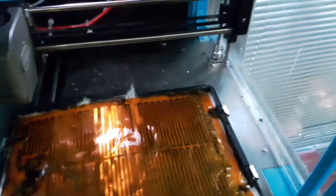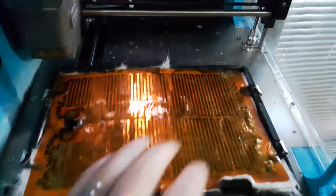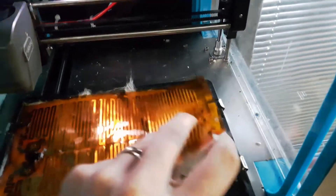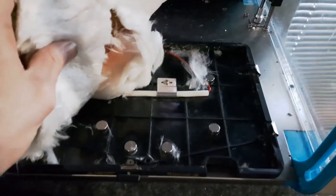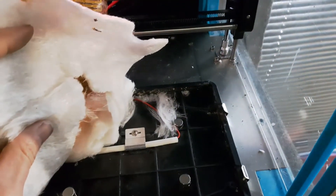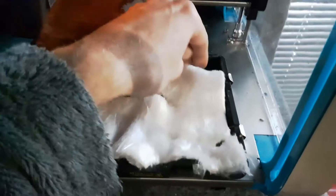Because they're quite deep, these magnets are much stronger than the other ones, and it doesn't matter that they're separated by the full thickness of the aluminium sheet — they still have a good strong pull on the steel bed. So rather than mess around milling, you just put lots of magnets under there. I've gone a bit overboard really — magnets in the aluminium sheet and underneath. That's a thermocouple in there I would guess, probably what measures the bed temperature.